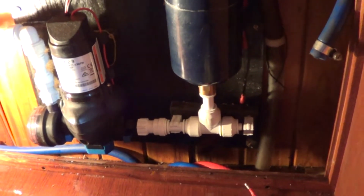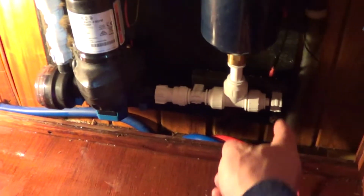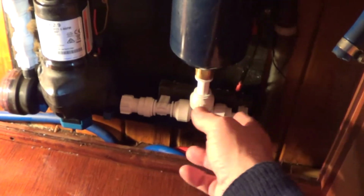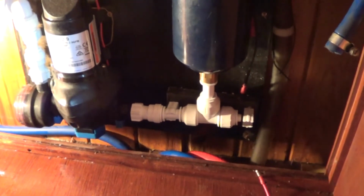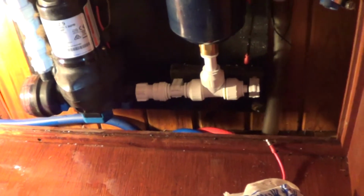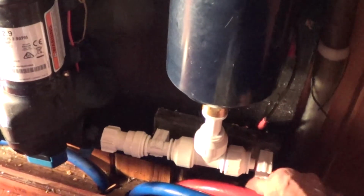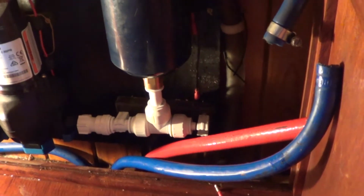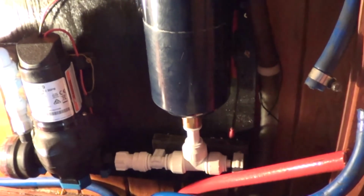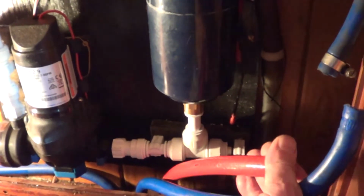As I say, I should now run the feeds off in the poly pipe. Unfortunately it's a bit backwards way around how it's worked, but that won't matter. I can put a feed in and then a take off. For temporary, for now, there's the two shower pipes there that go to the shower down there, which I've just cut off. I might just use those in that pipe for now, then eventually pull some of this plastic water poly pipe through and use the proper fittings. There's nothing wrong with this, I mean, this has been used on boats.